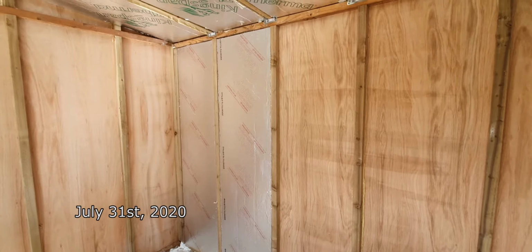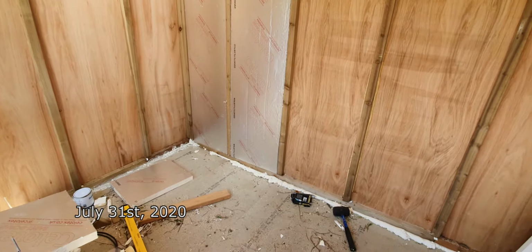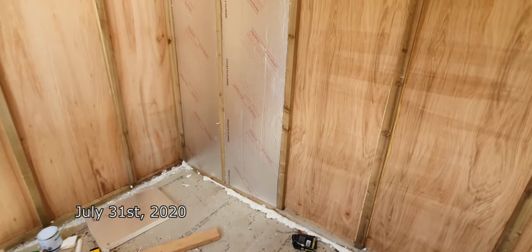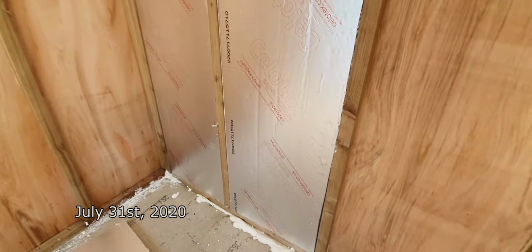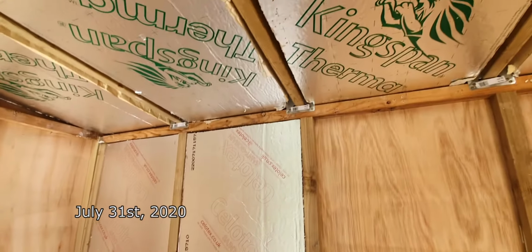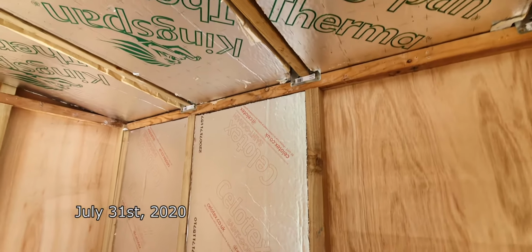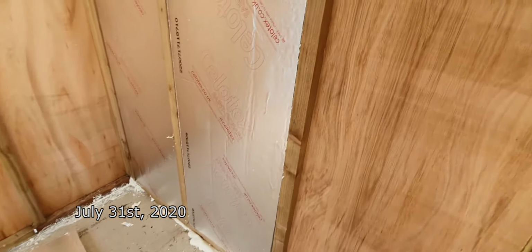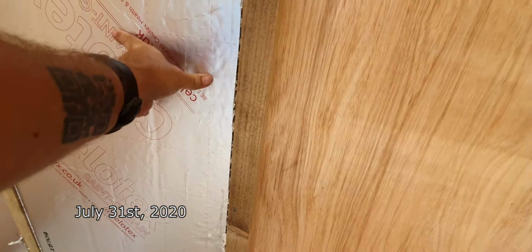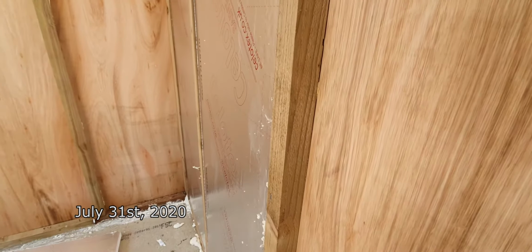This is the 40mm Celotex sheets going in. They were delivered in a van today. I'm cutting these to about 50 centimetres and just over 2 metres tall. They're a nice snug fit and just the right thickness for my wall beams.